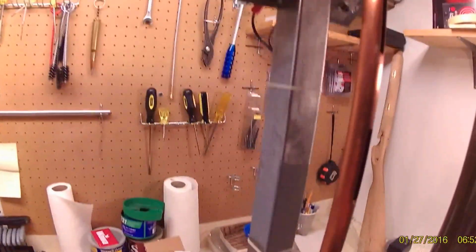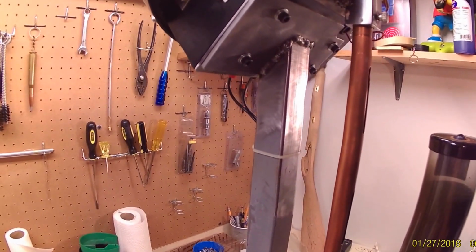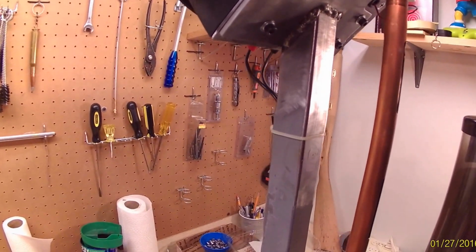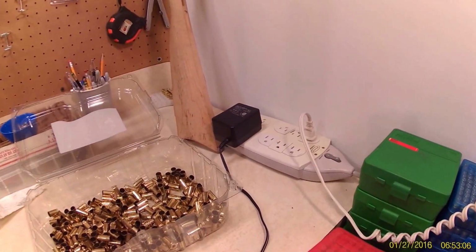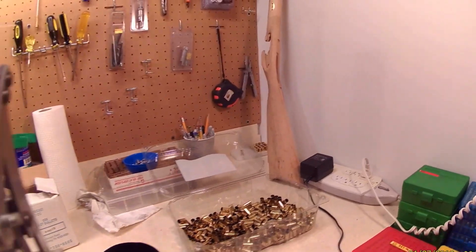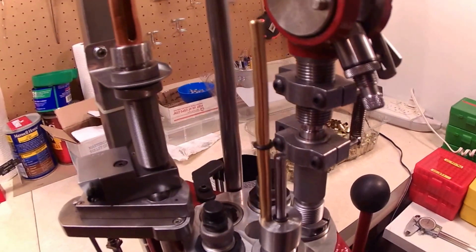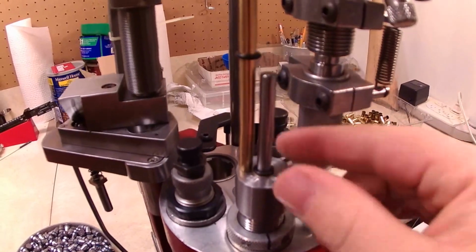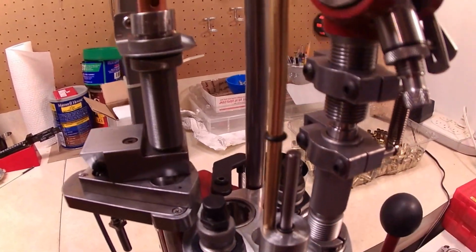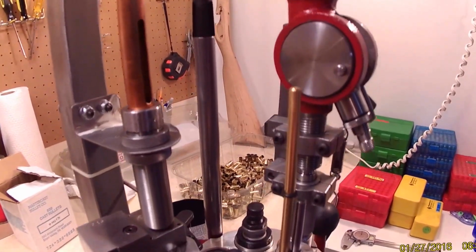The motor that's inside this case feeder, I got it from Amazon. I think it's 4 RPM. It's just a 12 volt DC motor, gear driven. To power it, you got your hookup, and it goes to just a power pack. Nothing special. What else did I do? This is a powder cop I made for it. Again, just machined it out of a bar. Works just like theirs. I don't use it for all my calibers, only certain ones I can't see in so easily.